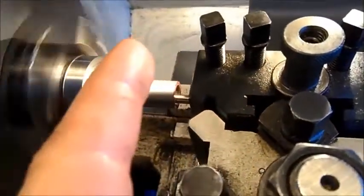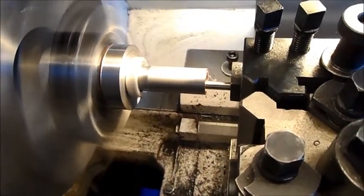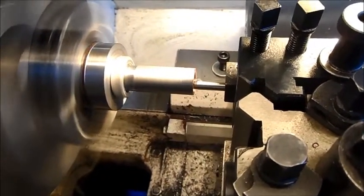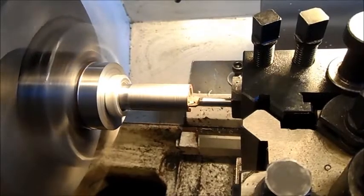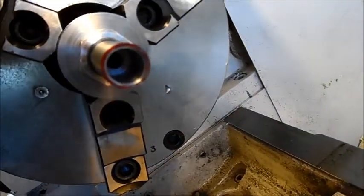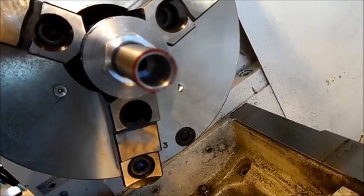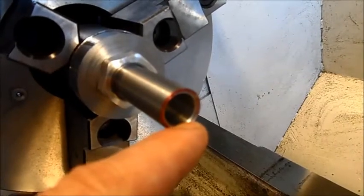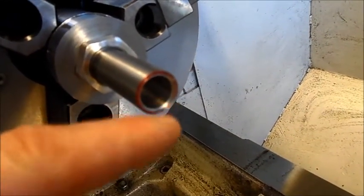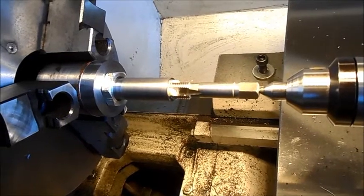We can take a peek down the hole. I tried to push a bullet through and that is possible - tight fit and good fit. This is a little counterbore down here. I don't like my threads sticking all the way up. I'm a bit lazy and don't want to single-point cut it today, so we'll use a tap - run it down. This is an M16 by 1.5. I should have had M16 by 1, but I couldn't find it. This thread is approximately the same as the Lee one - finer thread is better for adjustment.